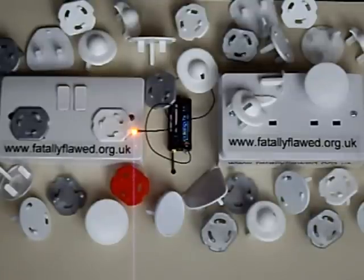Let's have a resume of what we have discussed. All plug-in safety socket covers made for UK use fit the standard BS1363 flat-pin socket. All BS1363 sockets already have internal safety shutters to prevent children poking objects into them, and this has been true since their introduction in 1947. Therefore, all UK plug-in safety socket covers have no practical value. However, all UK safety socket covers are, if inserted upside down, capable of defeating the inbuilt shutters in sockets, with the exception of MK sockets. Therefore, all are dangerous. In addition, the most popular socket cover types have additional design flaws, leading to even greater danger.